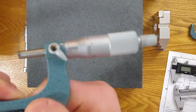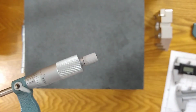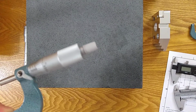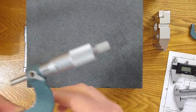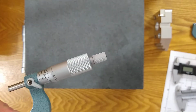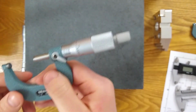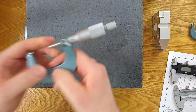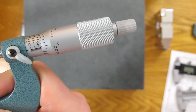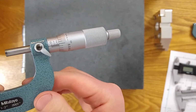It really comes down to how thick these lines are, because if they're so thick that you see them really well, they're not useful because they overlap, they don't give you any precision. And if they're too thin, they're hard to see, and they may be hard to manufacture that thin repeatedly. So they have an increment that's a compromise that you can see well. You can still use the micrometer as intended. The downside of that is sometimes the lines are so thick, they start to peek out when you get close to the thimble and you get close to that rotation.